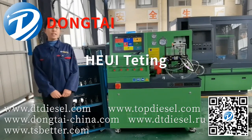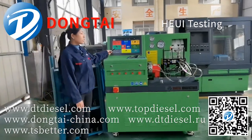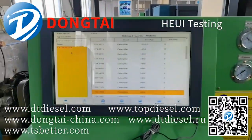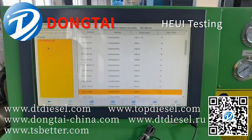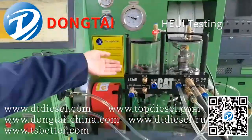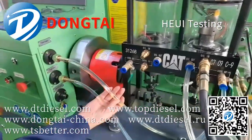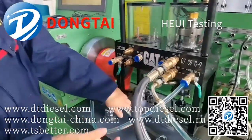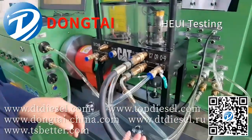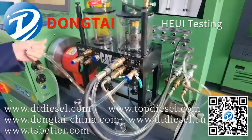Now we'll show you the HEUI function for testing caterpillar injector. First, please check the system. You can choose the injector number here for caterpillar. Next, let's move to the connection of the HEUI stand. This two oil pipe is for diesel oil. Oil in and out. This two pipe is for engine oil, in and out.